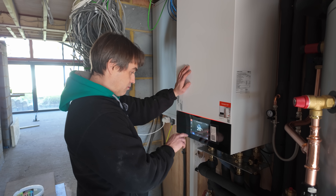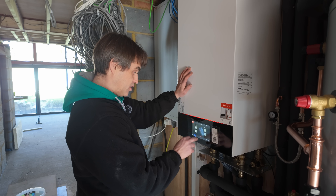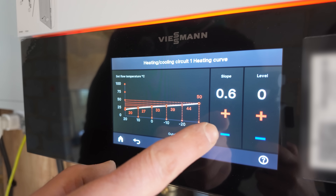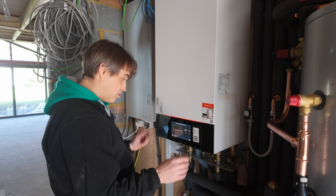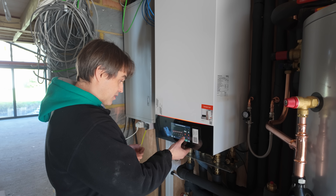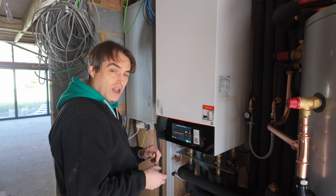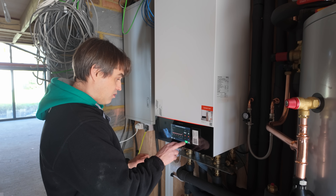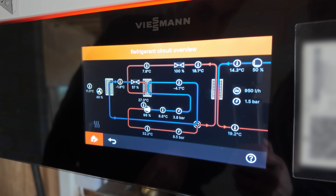The very last thing I'm going to do is adjust the heat curve. It's a building site with new screed, so there's a screed-drying profile available, but I'll simply adjust the heat curve to a very low one. Out of the box it's set to 0.6 — you can adjust both slope and level, which is really nice. We need to make sure the floor doesn't get more than 20–25 degrees flow, so I'm dropping that curve to 0.2, which gives us 24 degrees at 0°C outside and 26 degrees at minus 10°C. Minus 10 is very unlikely this year, so we'll be safe to leave it at heat curve 0.2.